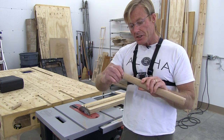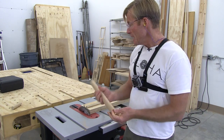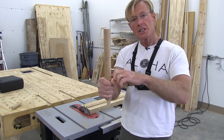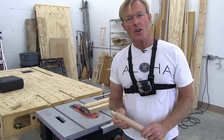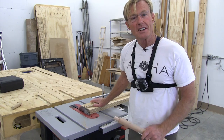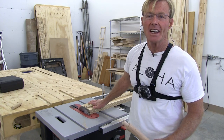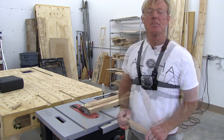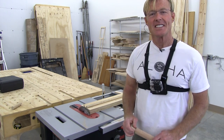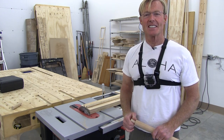Now it's cut down to 20 millimeters. I just take a piece of sandpaper and sand the rough edges off — it centers it perfectly. Then I'll put it on the miter saw and cut it to about five or six inches, and I can make another one. This is a job that could also be done on a lathe, but I don't own a lathe and don't plan on buying one. The plywood is just scrap and only took a few minutes to make, and I can toss it in my trailer and have it on the job site. If you find these tips helpful, give the video a thumbs up, subscribe to the channel, share it with others, and if you want to see workbench plans, click on the link in the video. Thanks for watching — have a great day!